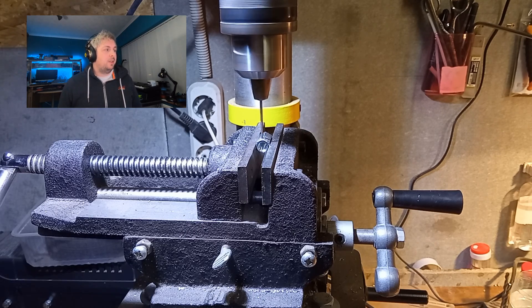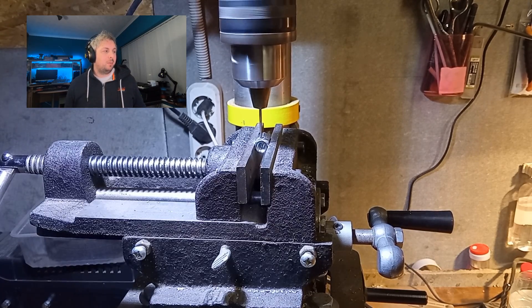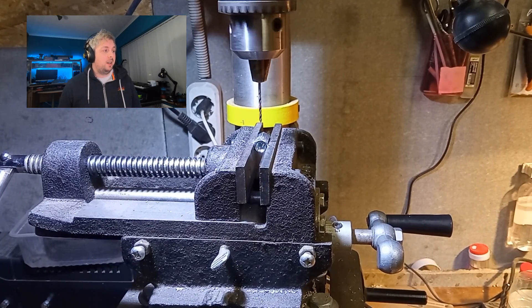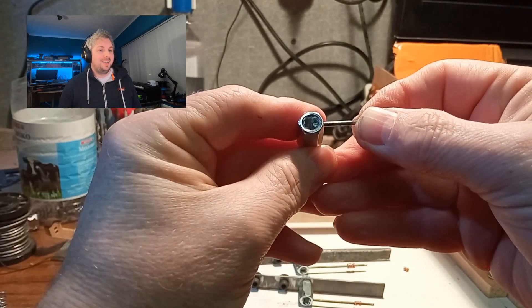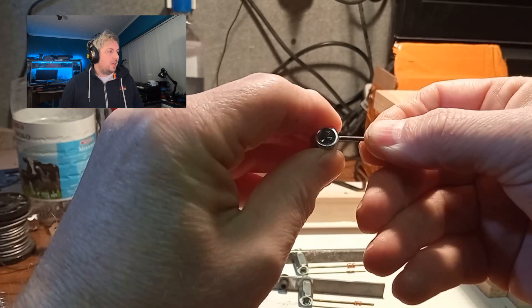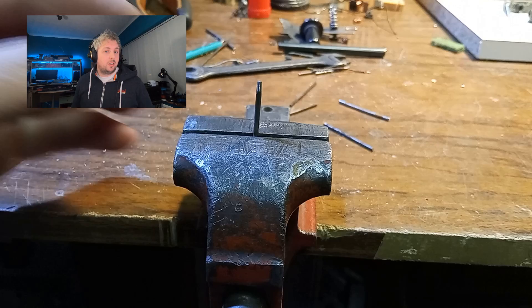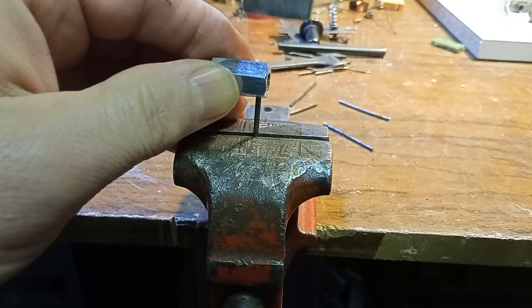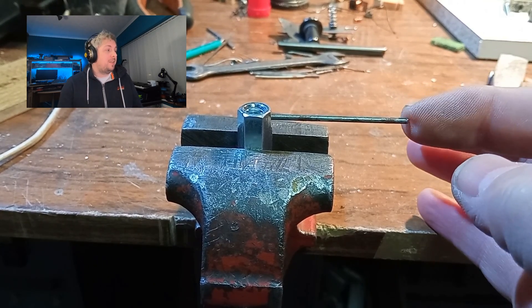The wire is slightly thick, so I'm going to guess this is probably a 1.5mm drill bit with 2mm wire — that'll just allow it to be an interference fit and we can hammer the two together. The hole is smaller than the tine, but if you grind on a small taper you can work it partly on, then clamp it in a vice and give it some gentle persuasion. We clamp the tine in the vice, get our long nut, and start hammering it on. Then the final step: let's test this.